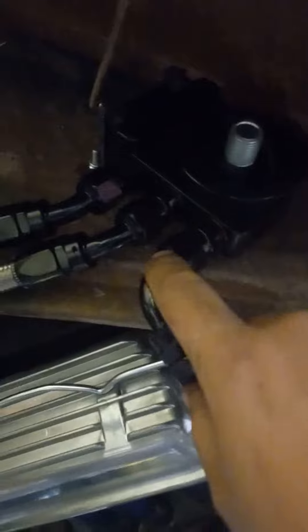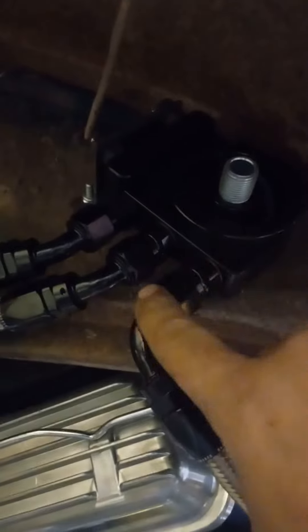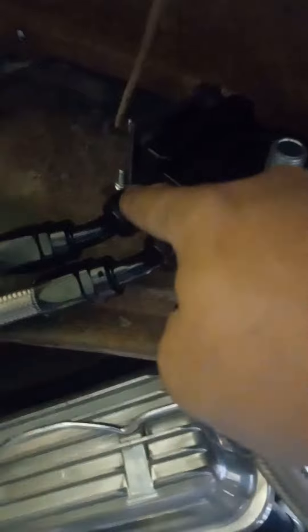We're going to come out of the pump and go over here to the bypass. This is running bypass oil control, so there's actually a regulating pressure externally and not internally in the case. This is your inlet, this is your outlet of the filter, and this is your bypass.